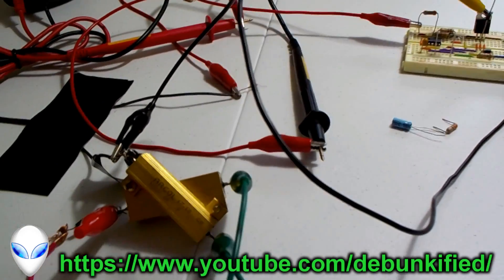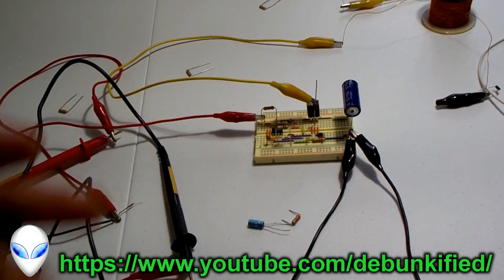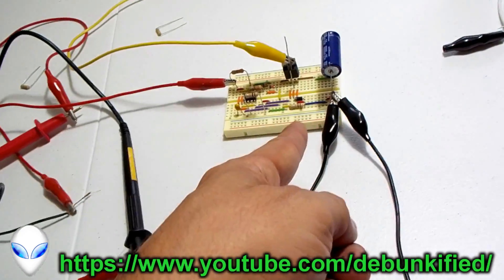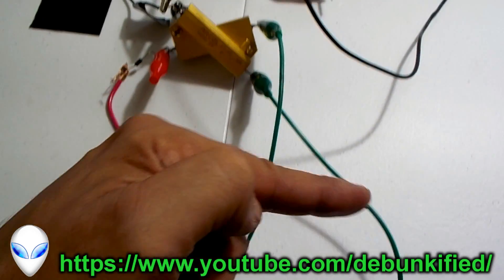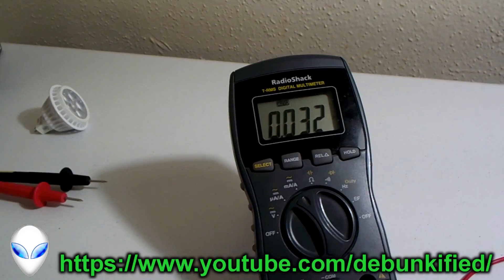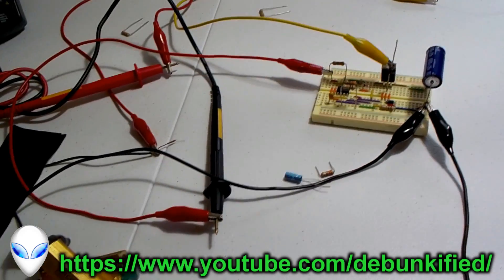We've replaced the battery with a power adapter. It's a little messy but real basic and simple. We've got a 555 timer circuit being run from a power source right here. The negative is going right directly to the negative. In a second I'm going to show the negative going across two resistors and through a diode, to show you that the power running 32 milliamps through our switching circuitry actually increases the voltage over here in our self-charging capacitor.